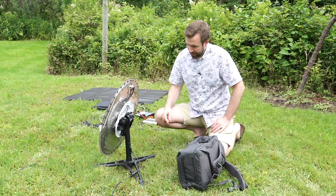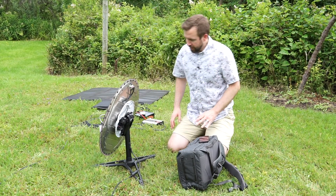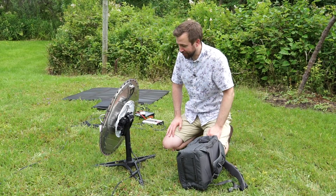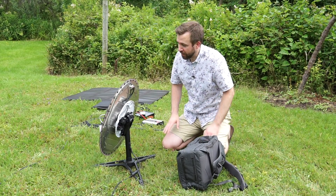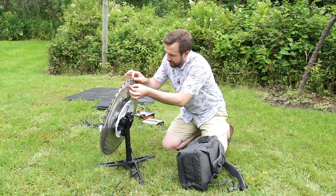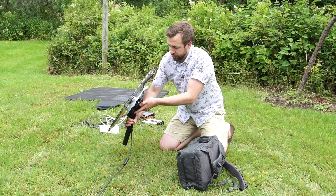That just flattens it out so the post is out of the way — I'm not going to remove it for this video just yet, I want to make sure it works first. Then I'm going to power it off by shutting off my inverter. Mine is naked — I've taken the cover off as you've probably seen in my other video. I'm going to actually unplug the motors. I haven't tried this before, so I'm hoping this doesn't burn out my motor controllers. I hope they've made it resilient to that. So I'm going to unplug the motor controller, which should just make sure it won't move anymore.